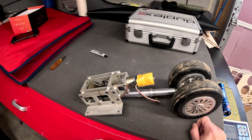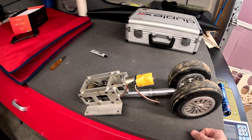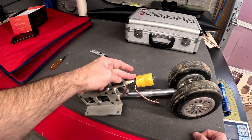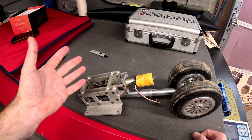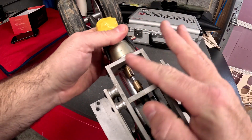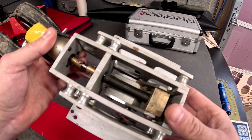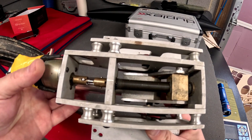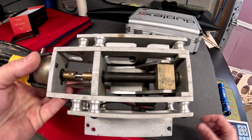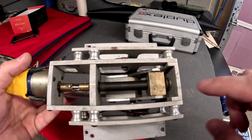I was told they were Glennis when I picked it up, so that's what I was going off of. It's a very simple design — just this offset spur gear motor, about a 19-volt motor. There's a little dog bone with two brass couplers to take up any offset between the motor shaft and the actual jack screw. The jack screw is just a regular bolt, honestly looks like about 5/8 or 3/4 inch, fairly coarse thread — definitely not an acme screw or anything like that.